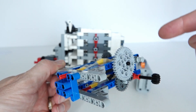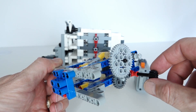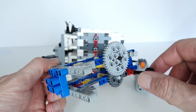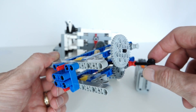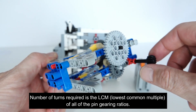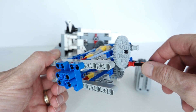In general, if you add more pins and more gearing ratios, then the number of turns required is the product of all the different gearing ratios, provided they don't have any common factors. If they do have common factors, those have to be divided out. So in general it's simply the lowest common multiple of all the gearing ratios used for the different pins.